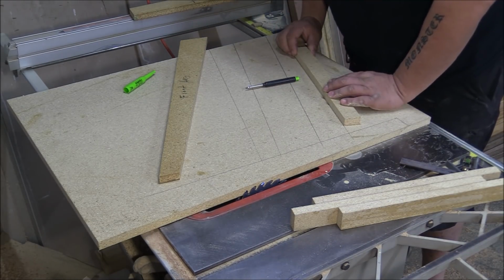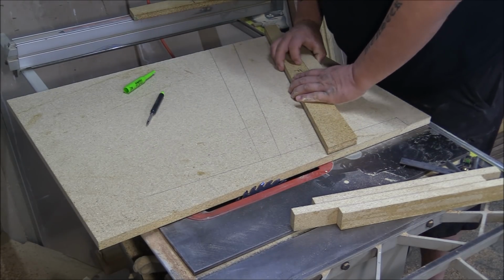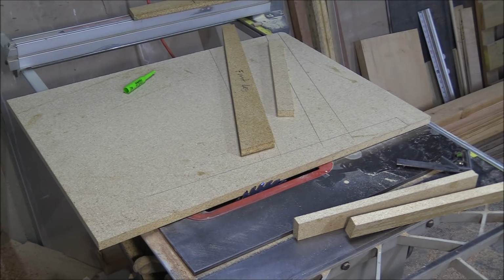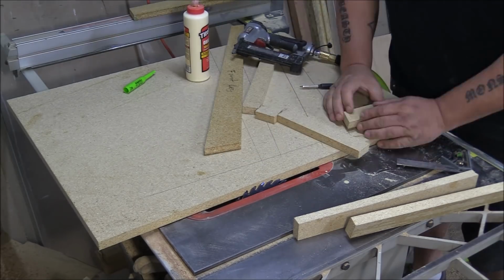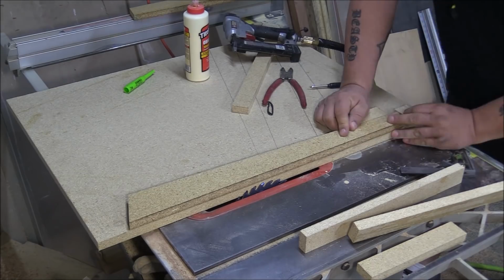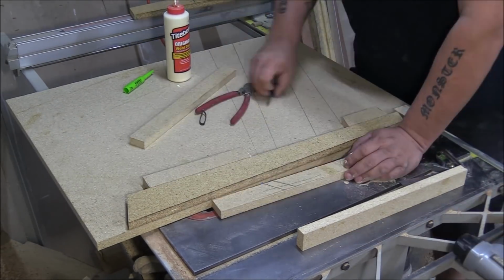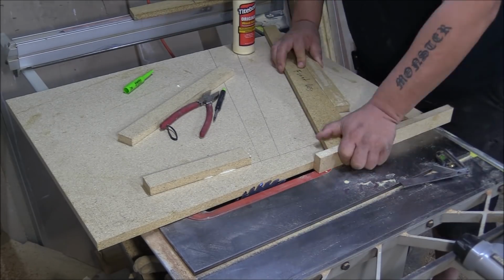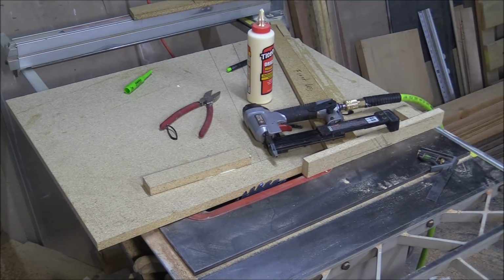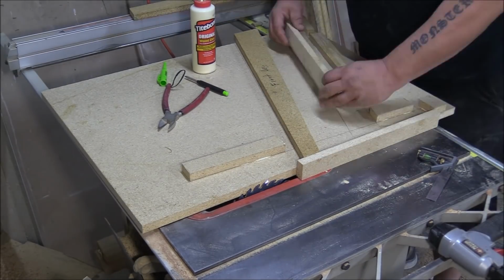In this case, this is the front leg, I believe, and what I want to do is create a table saw sled that cuts the entire part. When you're doing batch out work or production work, you really want to handle the material as little as possible, and when you do handle it, accomplish as much as you can. So in this case, this sled will cut the taper and all the angles for this one piece. So you can use your piece of 2x4 or whatever you have, and you cut it once. You pick up the part one time, you cut the whole piece, and it's done.